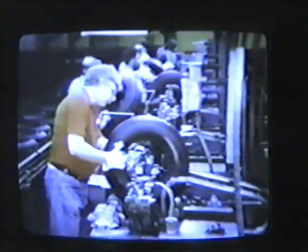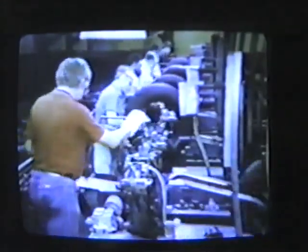After 100% manual inspection to pick up any irregularities or cosmetic defects, the finished product is transported to the Tire Uniformity Optimizer module. Here, the protective black rubber coating is ground off the white sidewall, and every tire is inflated and subjected to a computer-controlled operation which optimizes its roundness and uniformity while simultaneously inspecting the sidewalls.